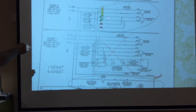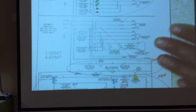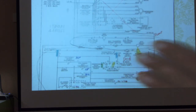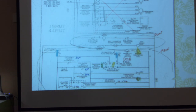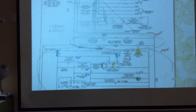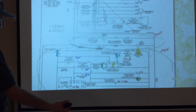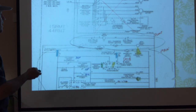I have these circled in sections so we can break this diagram down into four sections. There's the compressor and beater section at the top that we just covered. Now here's the pump section. The pump uses what we call a rubber band pump — it uses a rubber tube and a gear mechanism that squeezes the rubber tube, picks the mix up from the bottom, and delivers it up into the freezing chamber.